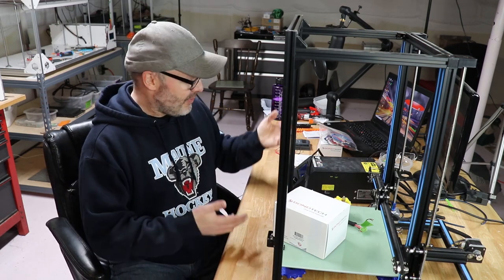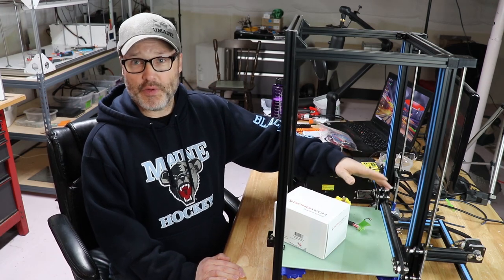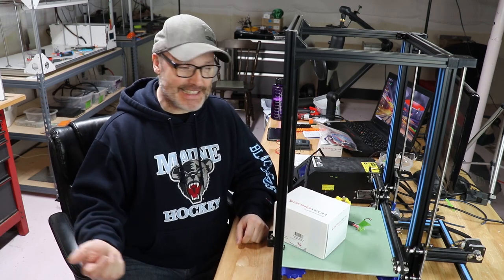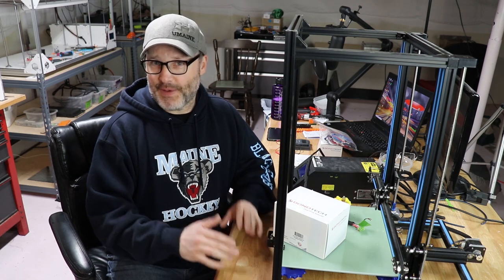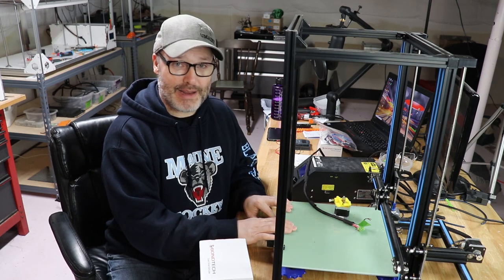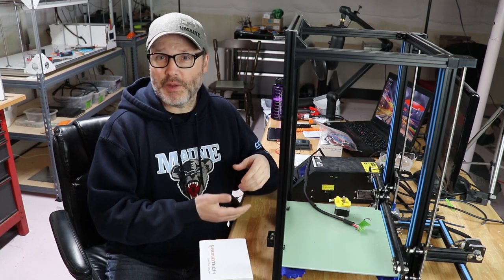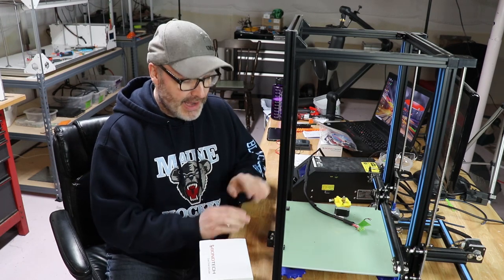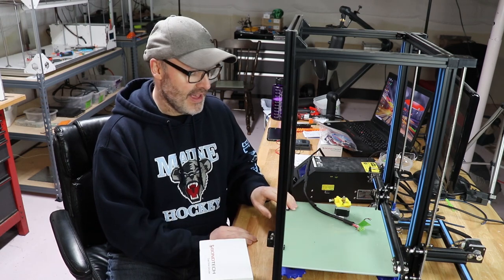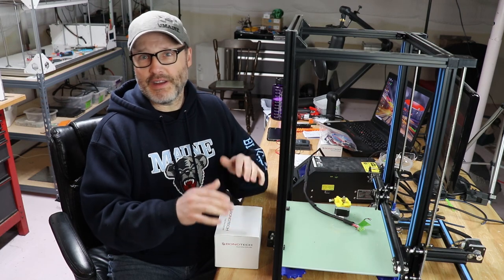As I mentioned in the intro, this is originally a CR-10, upgraded to CR-10S electronics with a dual lead screw. On the back with the dual lead screws, I went with solid couplers — on my CR-10S the flexible couplers that can split apart haven't been fun. The bed surface is a polypropylene bed I got from Tiny Machines. I've had really good luck with it. I'd love a magnetic PEI spring steel combo, but those are hard to find right now. Sometimes I add a dab of hairspray for better adhesion, but this build surface has worked pretty well.